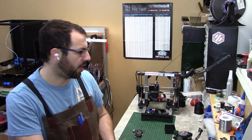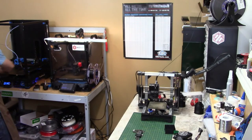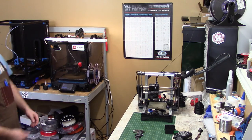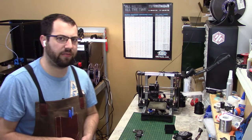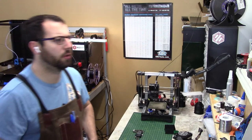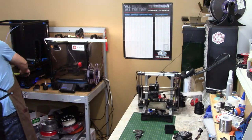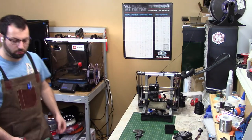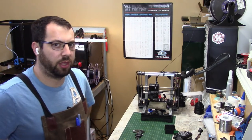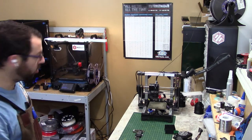Oh, space constrained. Okay. If you're worried about space, like 500x550. Yeah, so that would be a 350, I believe. So if you build a 350 spec V2, that'll get you within 550x550. Because my Tall Boy here is 330x330, and my X and Y are 490. So if you build a 350x350, you'll be within your size constraint there. For height, you would need to go shorter though.